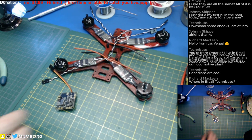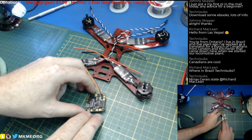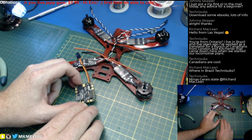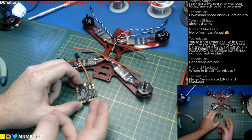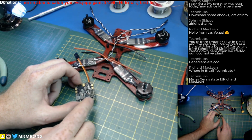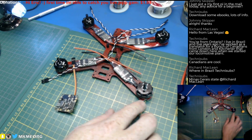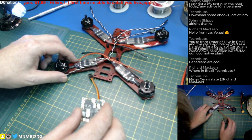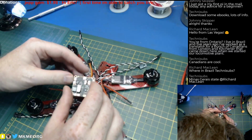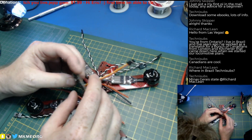we got to put, like I mentioned before, or maybe didn't, 2 wires each on 2 of those pins, because you don't want your video transmitter and your camera to be on separate places on the board if you're feeding them the same power, in this case we are. You're feeding them both LiPo power. You want them to be fed from the same point on the board. Otherwise, you'll run into ground bias issues. You'll have a different potential difference to reference voltage or ground going to your camera and your VTX, and that causes all kinds of grief and manifests as video troubles. Lots of nasty stuff that we don't want.